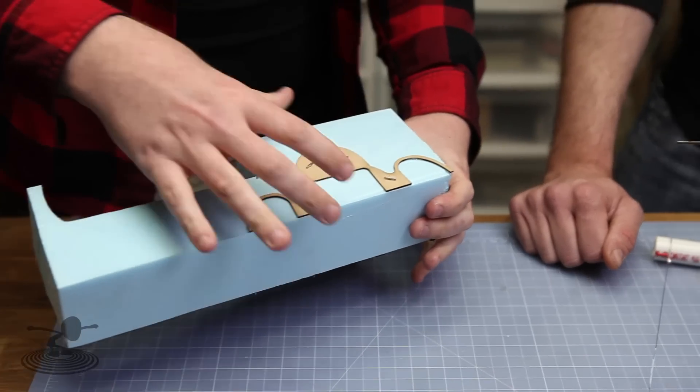The foam we used is four inches thick — I could get away with three inches, but the tolerances from the foam companies are not that great. So don't make your design exact if you're ordering foam, because when you get it, it might be scuffed or have parts chewed out. It's never good to rely on the exact thickness.